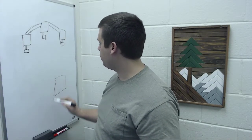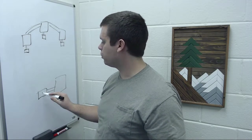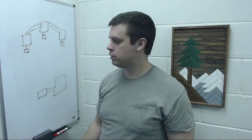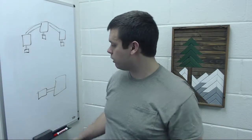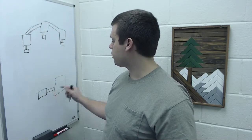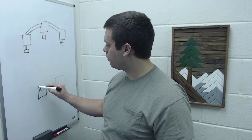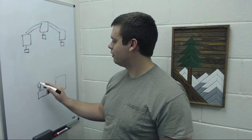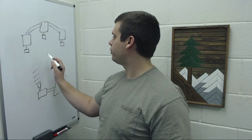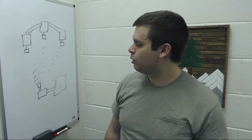We have this main computer over here. I would use an Arduino Mega that's connected over USB serial to the NVIDIA Jetson. And then this would have the Bluetooth module connected in here. And then we would send out the Bluetooth commands to each one of these, and it would send data back and forth like that. And that would be perfect.